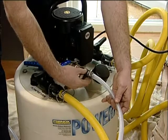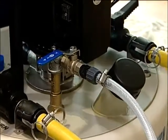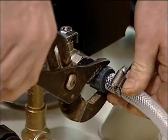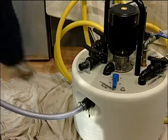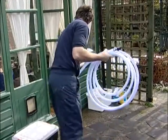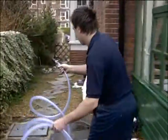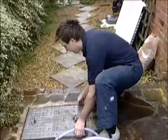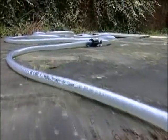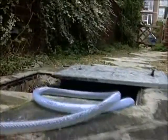Once the system has been prepared for power flushing, you need to decide on the best position to locate and connect the Fernox Power Flow flushing unit to the system. This will vary depending on the system to be flushed and the availability of suitable connecting points. Please use an RCD when connecting the pump to the electrical socket. The unit should be located within easy reach of a suitable foul drain or waste and near to a convenient mains cold water supply. The drain and discharge hoses and the mains fill hose are eight metres long to facilitate the positioning of the unit. The drain and discharge hose should be arranged to ensure that there is a continuous fall along their length.